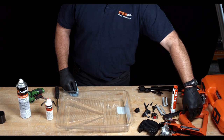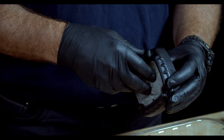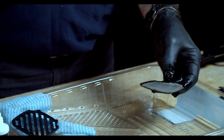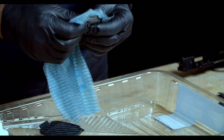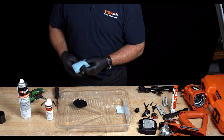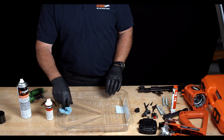Next, we're going to clean the air filter. Pick up the black rear cover that we removed earlier. Use your thumbs pressed down on the cap — under the cap is the air filter itself. Remove the air filter and spray liberally with the degreaser. Use your fingers to work the degreaser in to get any residue you might not be able to see. Put the filter back into position on the rear cover and place it aside to dry. With any extra degreaser on the rag, wipe the filter cap clean, replace the cap on the cover, and secure.